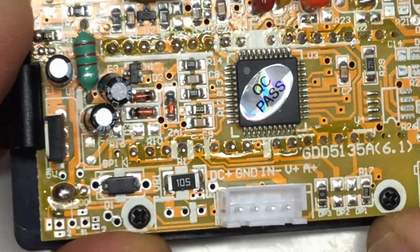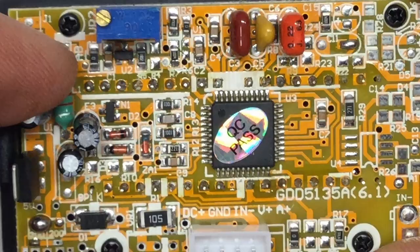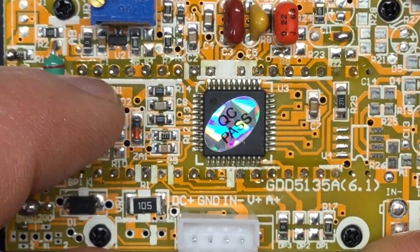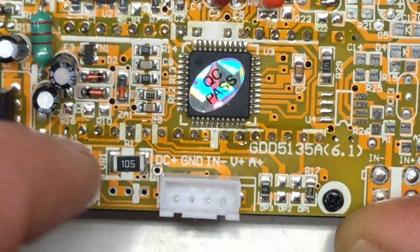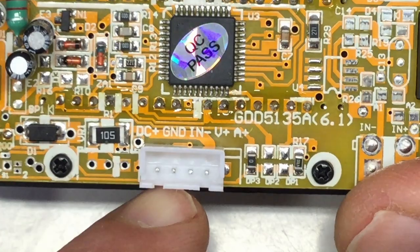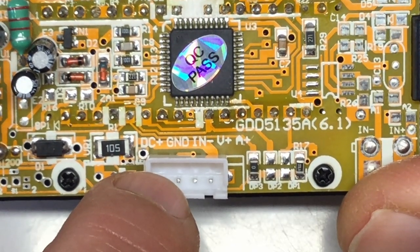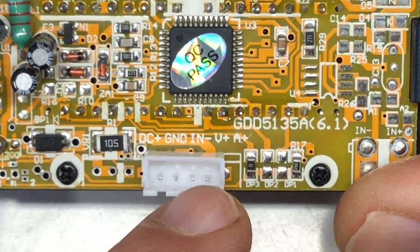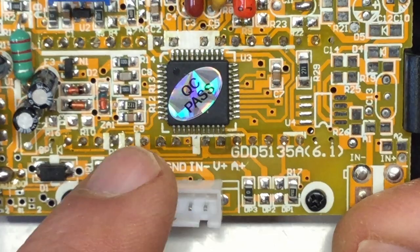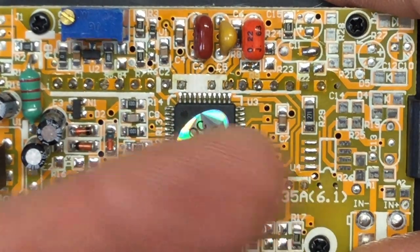And looks nice enough. Or voltage regulator. I don't know why they need the big resistor, but lots of diodes. I guess that's over voltage protection on the measurement input. All in all, very nice. But I'm wondering. Factory setting is common ground, but I don't really. I mean, this is our power supply ground and this is our measurement ground. I can't really see how you would get them apart. So I don't see any bridge or something, another 0 ohm resistor that you simply can take out.